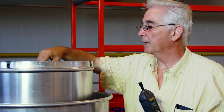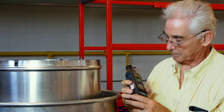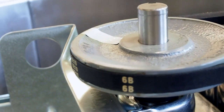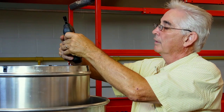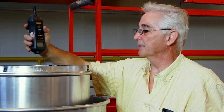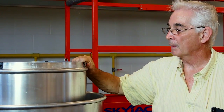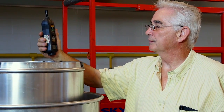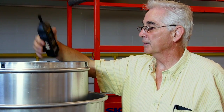We can also use a piece of reflective tape. This will work by reading the reflective tape — set it on, read the laser, and it'll read 865. It counts every time the reflective tape goes by. This is called a laser photo contact tachometer. We can use it either contact, which I prefer if you can, or laser if you can't quite get to it.